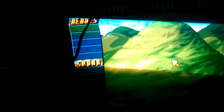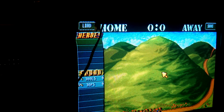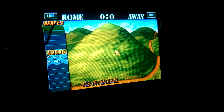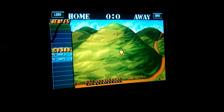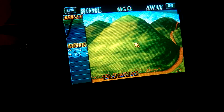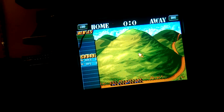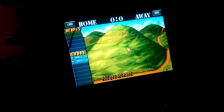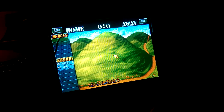This is what I mean by sync problems. There is a little jerk in the picture at the top, and it stays that way on certain stagnant images. I'm not sure if that's because this is a different resolution than 240p — could very well be. I can't really see that unless I was on something other than a CRT television. Due to the sync problems, this YPbPr mod does only work with CRTs. I can't get it to work on my 240p-supporting Samsung, or my other display which supports 240p but less robustly.